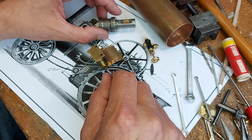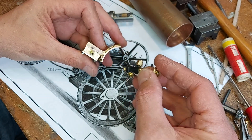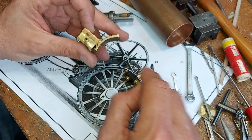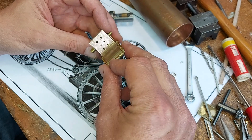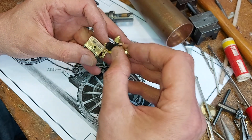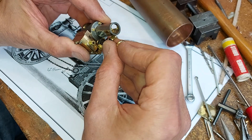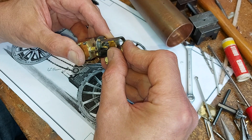I've still got to put two little piston rings in there — I'll make them another day. I'm thinking about whether to make a valve as part of this phosphor bronze part, but this is all getting very complicated. It worries me every day whether I'm going to mess it up or break a tap in it and have to start again. What I'm thinking is whether I could fit a standard valve into that side instead.